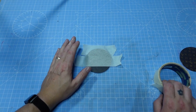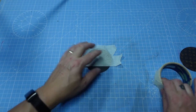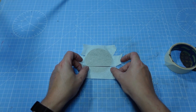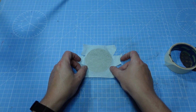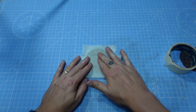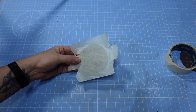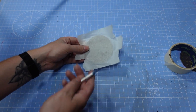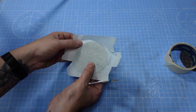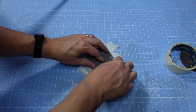If you do overlap it, sometimes if you haven't got a powerful enough laser it might not go through two layers, so you might have to run more than one pass - and trust me, that is a pain. Try and get it lined up perfectly, just take your time with it. Once you've got it covered in masking tape, I like to flip it over and cut the excess off. You don't need to do this step, but when you're moving it, it can all bunch up and come off.